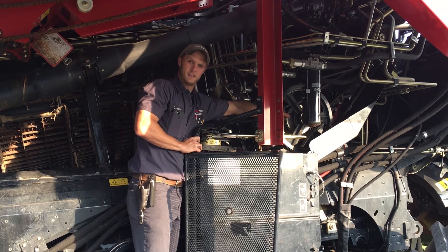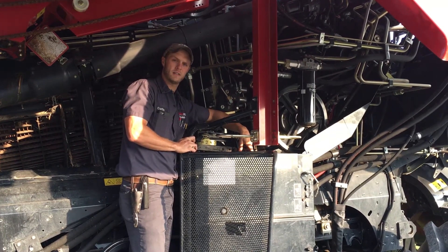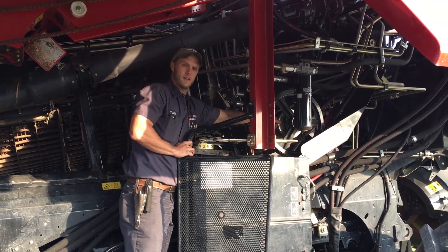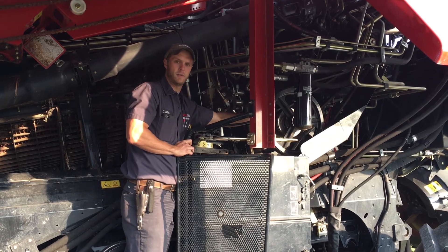The chopper shift is here in the center. Some of you have electronic shift, which can be done in the cab or down here by the battery box. If not, you just have to lock these two together. You may have to give your pulley a little bit of a shake to get the splines to line up and get it to pop into gear.